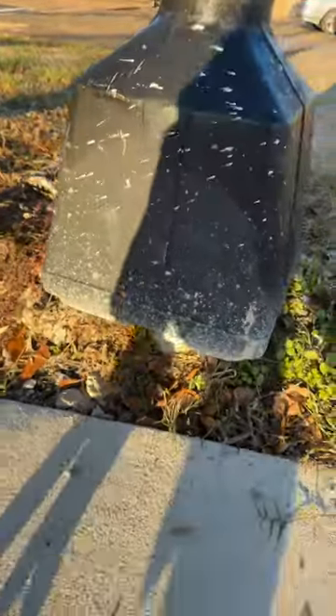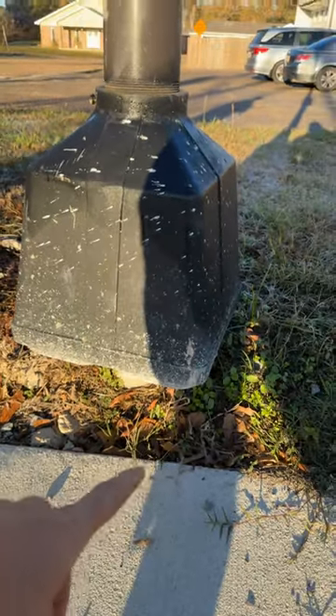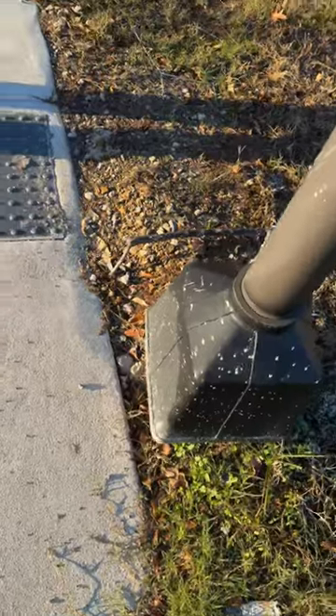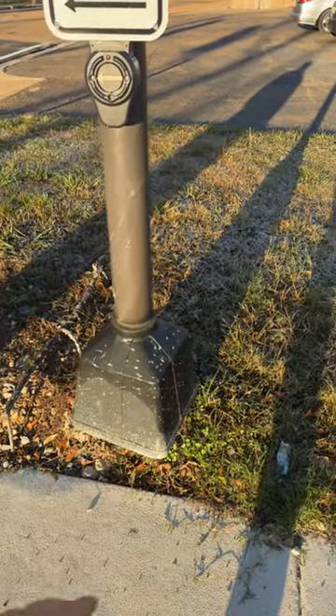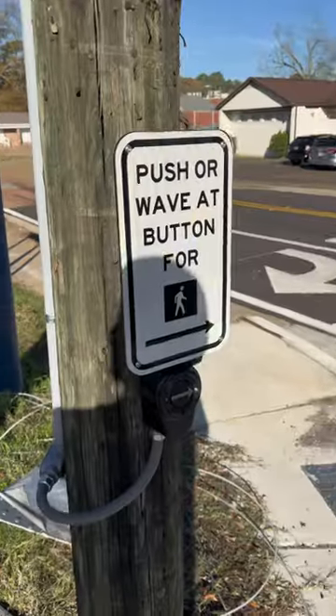This base is a little high from the curb here. What I'm hoping to do is get like a 12-inch or 16-inch sonotube, come right at the edge of this sidewalk, and build up like a little collar of concrete to the bottom of that thing — and hopefully they'll be happy with that.